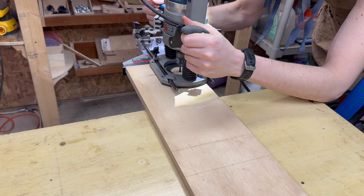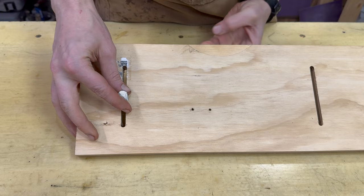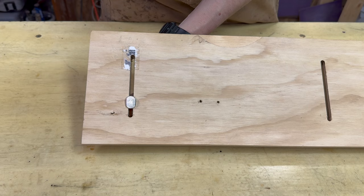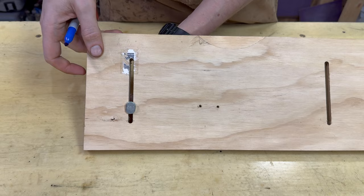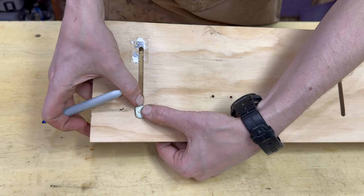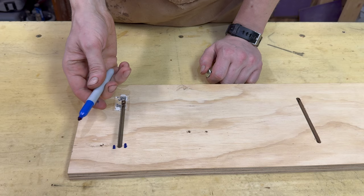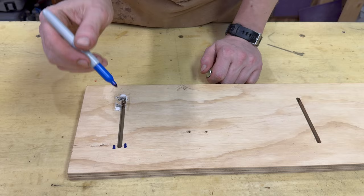Once you've got your grooves cut, flip it over and grab a T-bolt — we're going to slide it through and cut a shallow slot for the head to sit in so that when we move the fence it can slide around, and when we lock it, it can only turn a little bit. Place your T-bolt in there. I suggest using a normal-size Sharpie for alignment — hold it down, mark either side of it. The right width is to take away just a little under half of a standard Sharpie marker's width; that lines up almost dead perfect.